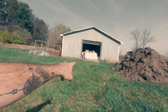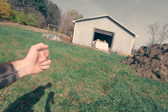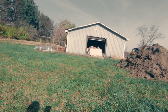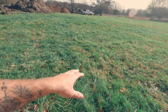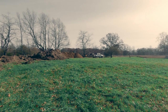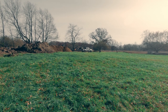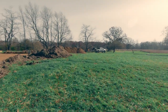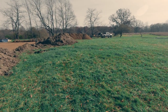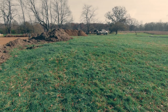We're going to take the concrete pad coming off of this barn, cut it with a demo saw, pull it out, and dig about 11 feet off of that building coming towards us. That's going to be a big concrete pad, but it's going to come level, so we're actually going to raise this whole area out here. About where Rick is, a little to his left near the edge of the sand pile, we're going to cut a swale so that water from this area will drain out that way. Right now it looks like I'm about a foot and a half below where Rick is, but he shot it with the laser and said it's not that far off.